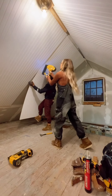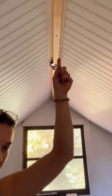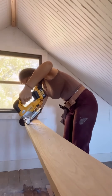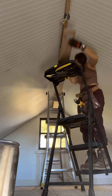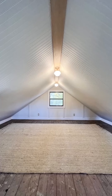Real life projects are hard and long and fun if you have someone to do it with. For this part I'm going to do a beam. I've added a 2x2 board so I have something to drill into, with 3-inch wood screws driven into the studs. Then I have this 1x8 piece of oak and I'm going to drill holes for the light fixtures and pop it up. I'm using a drywall circle cutter to make a perfect circle outline, then plunge cut with my jigsaw to cut out a beautiful circle. This is red oak, a 10-foot piece, and I'm going to fit the lights through here so it looks like a beam. I added construction adhesive, installed some lights, and there it is.